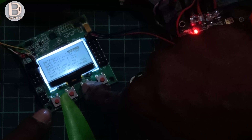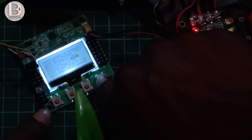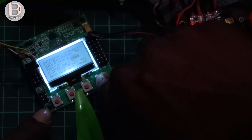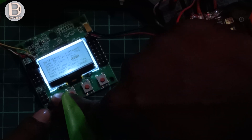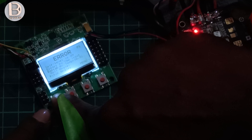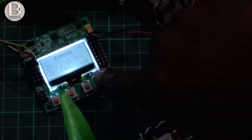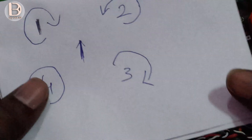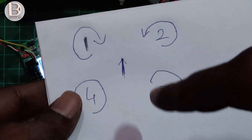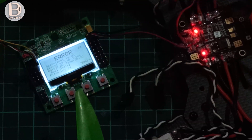For self-level, it's better to leave it always on. Come down to receiver type — I'm using PPM, so select PPM. That's it. Now mount the board on the quad, then connect the ESCs as per this layout, and I'll show you how to start it.